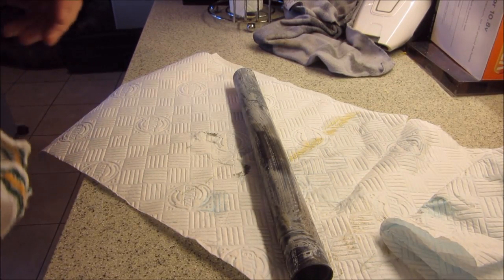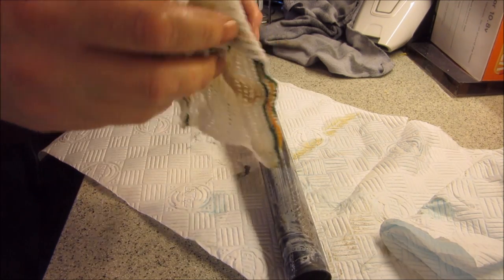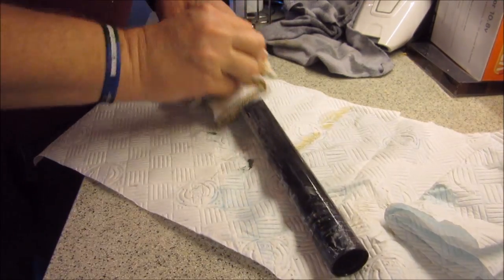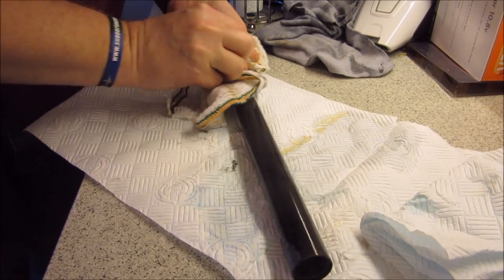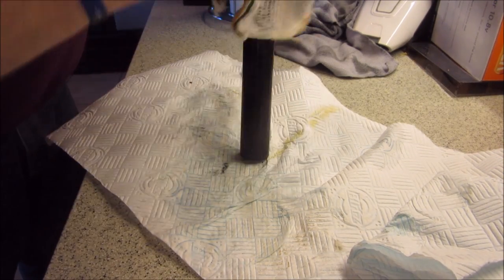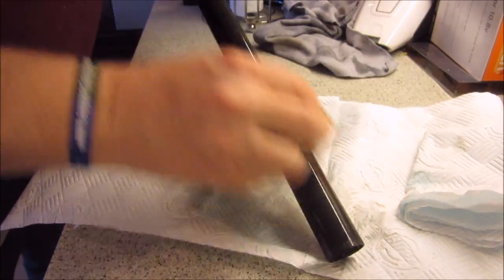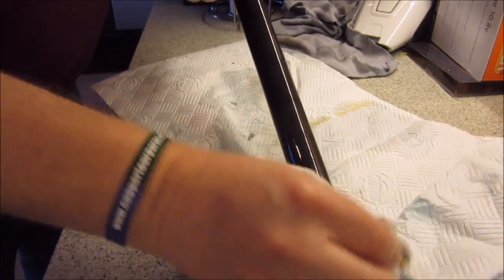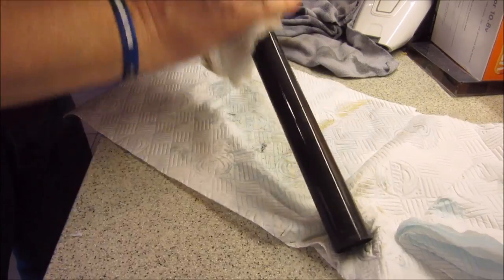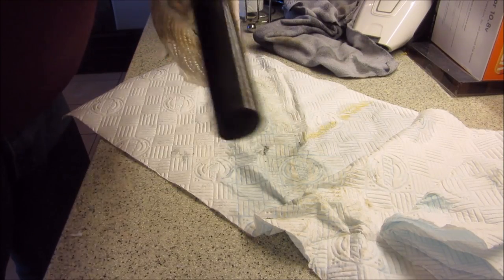Alright, as you can see, it's gone grey now, so should be ready for wiping off. I've wetted a cloth, I'll rub it off. Not a bad finish. I suppose you can go over it a few times really. The more you do it, the better sheen it'll get. But what are you supposed to do after you've got it off with a damp cloth? You dry it out and then put some silicon oil on it, and that helps to stop fingerprints.